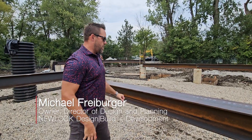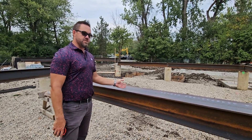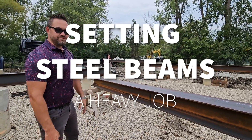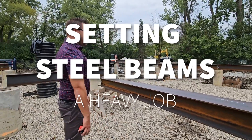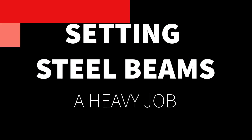The W-12 means it's a wide flange section — approximately 12 inches deep. When it says 'by 50' or 'by 60,' that means 50 or 60 pounds per foot. So 60 pounds per foot times 20 feet is about 1,200 pounds. When it's being lifted, it takes about three people to install: one person to operate the crane and two people to guide it.